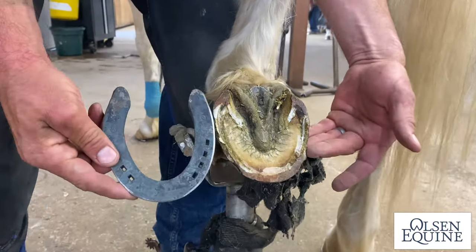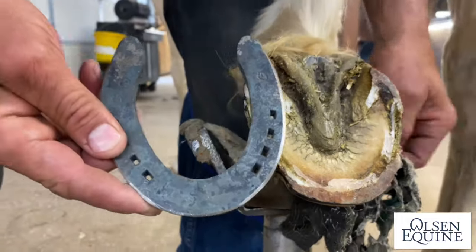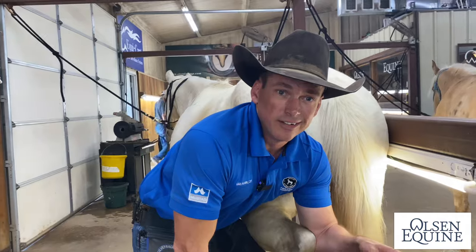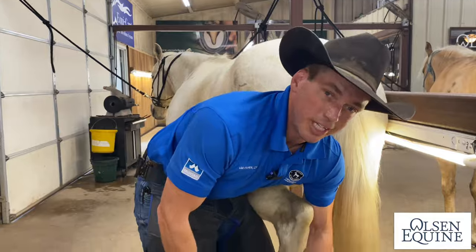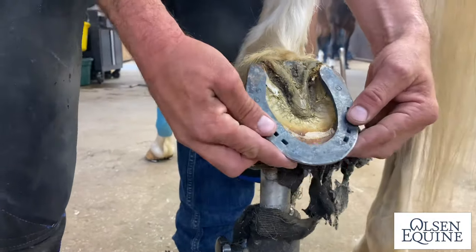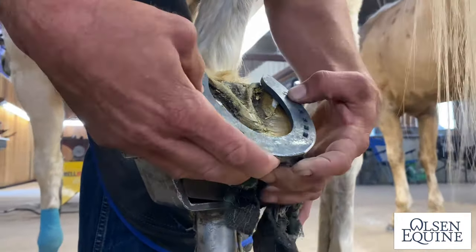So when it comes to this ugly shaped shoe — well, that's good, because this is an ugly shaped foot. When you look at this, you should always ask yourself: does this look like this? You want to balance in between what's there and what you want to be there next time, and you still have to fit the foot. It's a fine line we have to run. One more time — does this look like this? And as we slide it on down here, I would have to say yes. We're going to be able to nail in the white line.